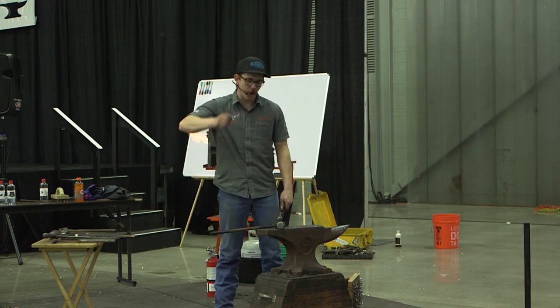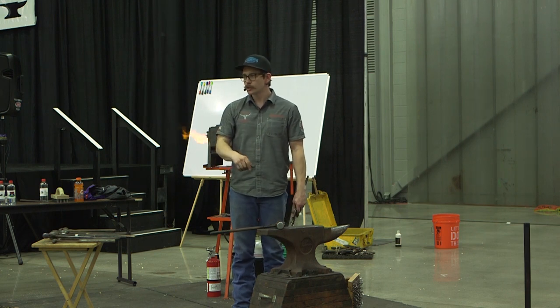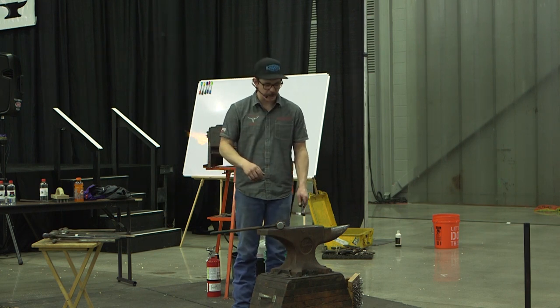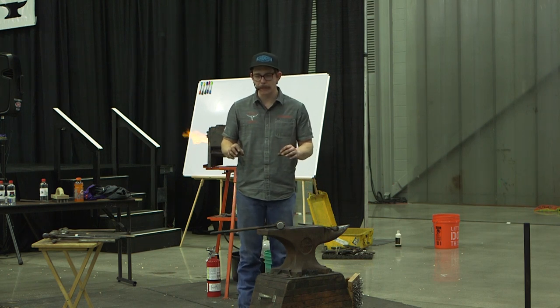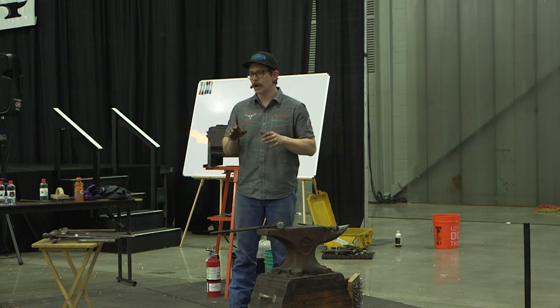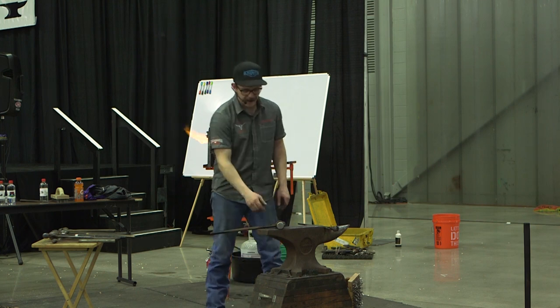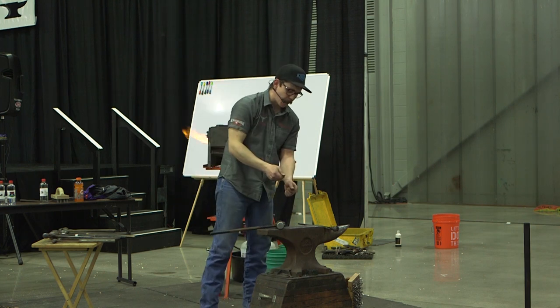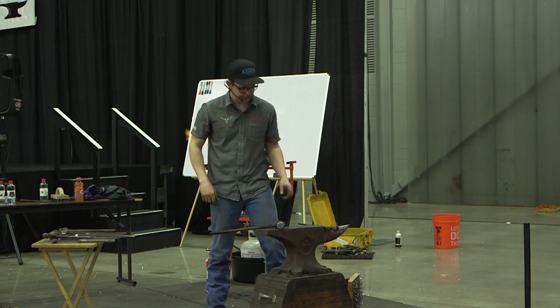And everybody kind of wants to go whipping at it a little bit. I'm sure you've heard the thing of swing through it, swing all the way to the bottom of it, get it down in there. It's something I learned from running power hammers: if you run a little power hammer, it flashes everything. You get a lot of mushroom. You run a big power hammer, everything comes out from the center. So if I can act a little bit more like a big power hammer and have a lot of drive through, I can get it more into my bump and not just clear out my ends.